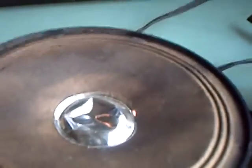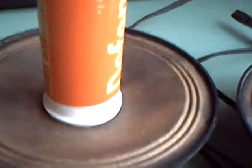What is the vitamin tube for? Well, I'm sure you've probably come across in your travels a speaker where some mindless idiot has done that. This vitamin tube — it occurred to me — fits just over that, and by applying a gentle suction it should be possible to pop that dome back out again. Let's see if my Heath Robinson approach works. Hear it click — and there it is. It's not perfect but it's a lot better than it was.